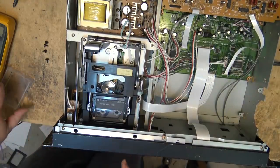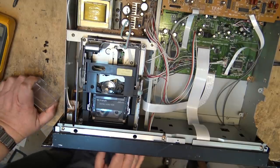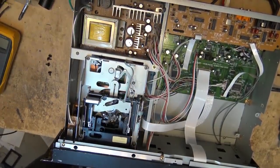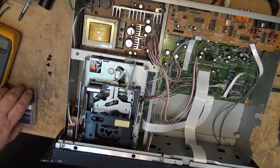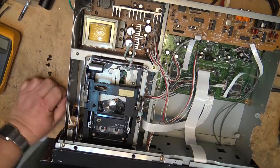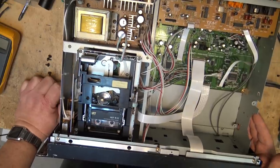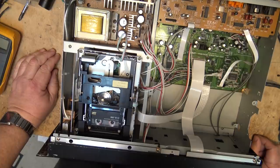What the problem with this is — I'm going to grab my royalty-free tape. I grabbed one that wasn't royalty-free; that'll stop this thing. One thing I should point out is these are not like working on old tube analog gear. They are very complex. You've got both analog and digital circuits. The analog circuits are easy to trace a signal through, but the digital ones not so much, because you might have a bit stream but if the clock is off or something is not quite right you'll get nothing through them — it won't decode anything.